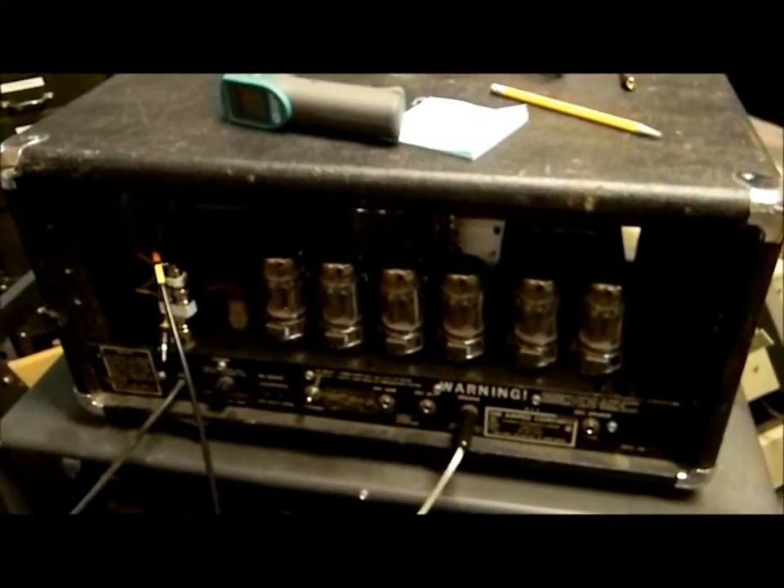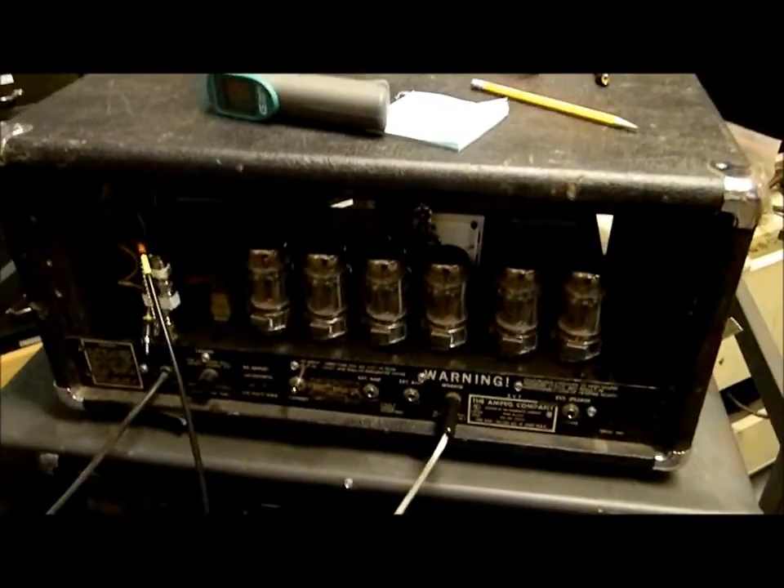That's telling me there's something wrong with those output tubes. And since I'm driving just the power amp right here, that's pretty obvious. Can't say it's the tubes yet — hopefully not the output transformer. This is the beginning of it, so I'll try to continue to document it in hopes that it'll help.